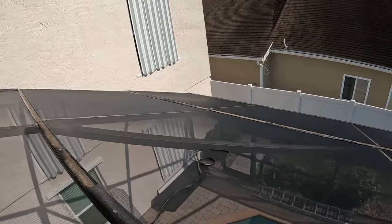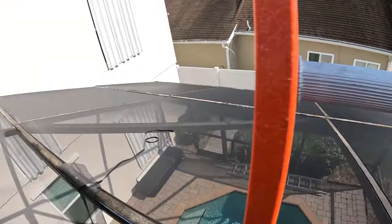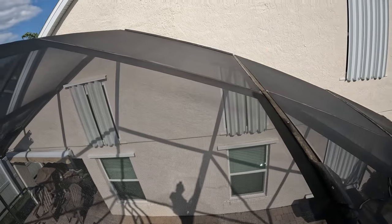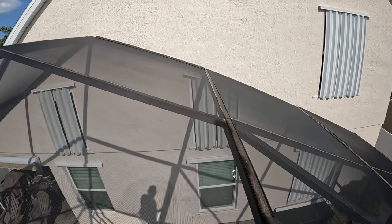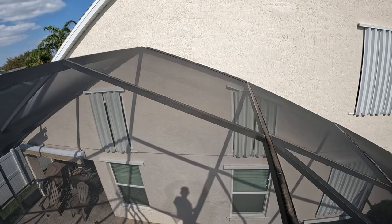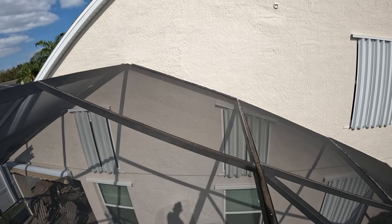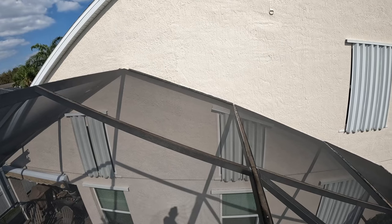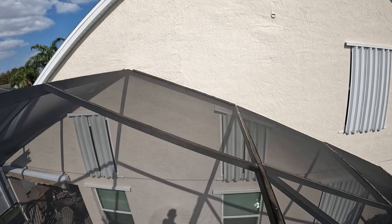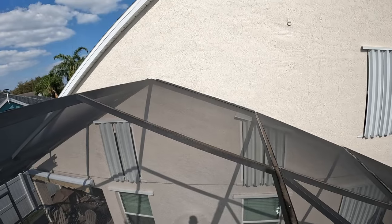These six pieces are all done — nice and tight. We're coming across here to number seven. These are seven by seven foot panels; there are nine of them on each side. There's also an aluminum drip edge at the top to keep water out from any connection points — it leads the water away.